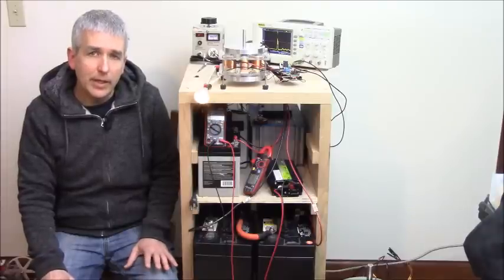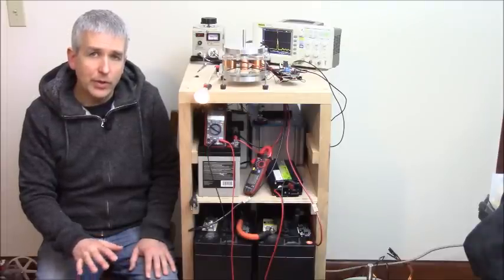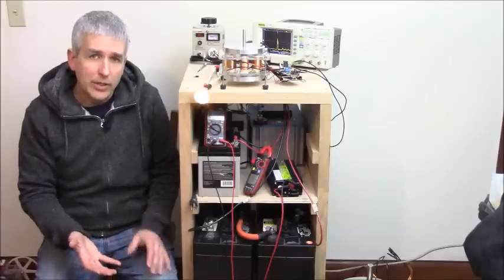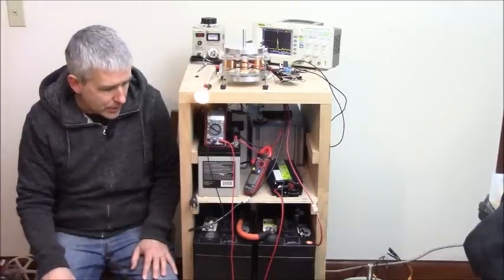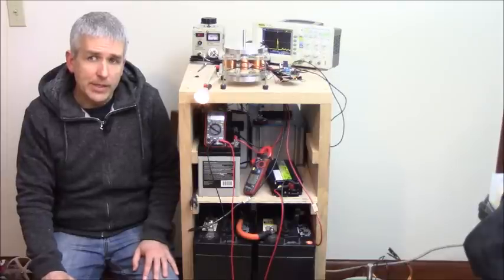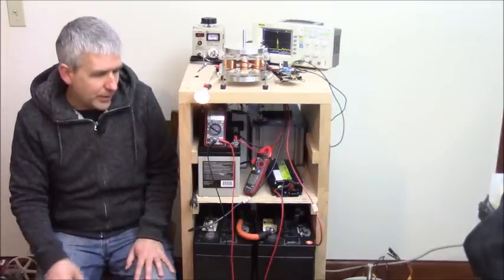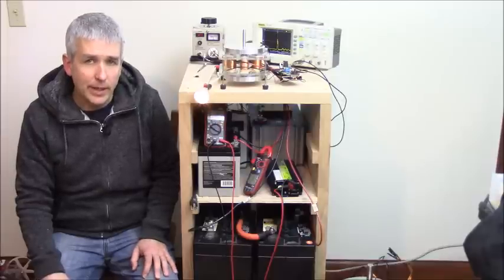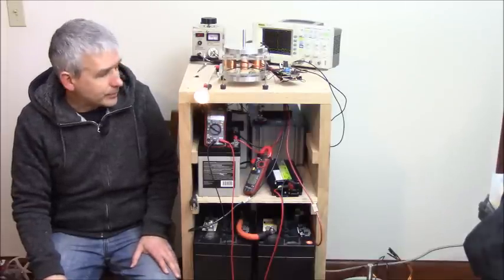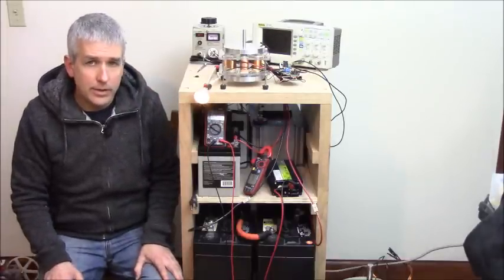If you have a sulfated battery, you want to only put enough water in to cover the plates. Don't put any more in until after you've done several cycles and rejuvenated the battery, because the water level will expand. That's what I was waiting for before putting more water in, because they've been sitting quite a bit over the years, and I really haven't kept them rejuvenated fully. They're still at the new capacity level, but, there we are, 6 volts. They are sulfated a little bit.